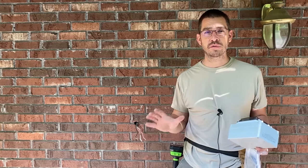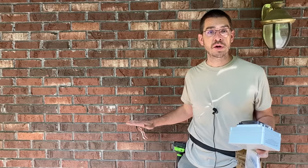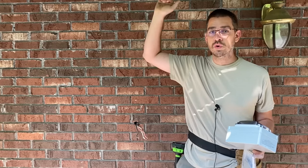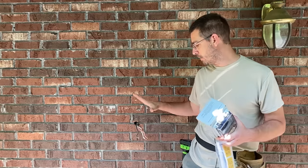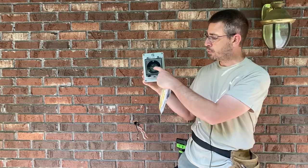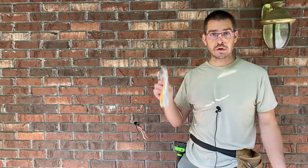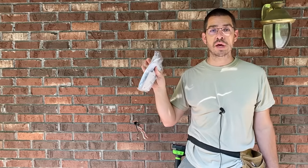I'll go through the whole install on this - it's not too difficult. There's one thing you're going to need set up previous to this part of the install, and that is some kind of wire from your panel to the outside. In our case we're using a wire that was existing here at the house, but you can hook up your own breaker in your panel and then just run a wire, drill a hole out of your basement or something like that. So on the outside of the house we have some wires coming out that are wired to the panel. We're going to put the generator inlet box on the outside of the house - it's a waterproof box. A cable goes from this box and plugs directly into the generator. It has a twist lock plug on it, and that's going to handle 30 amps. On the inside of the house on the electrical panel, you're going to need what's called a generator interlock kit. I'm going to go through why you need this and why this is a safety thing - this is code, you can't do this without it.